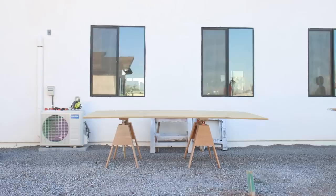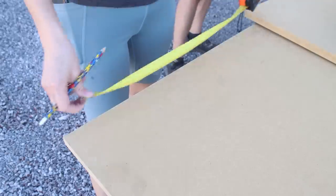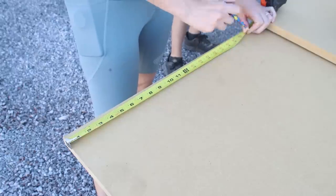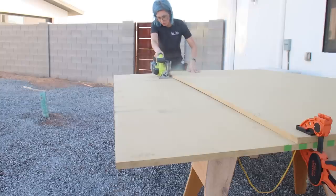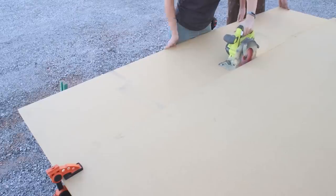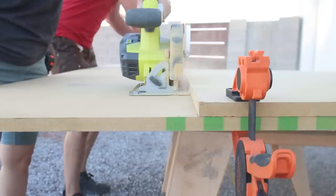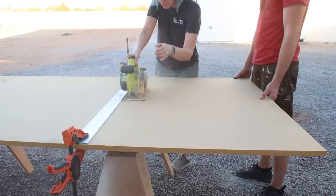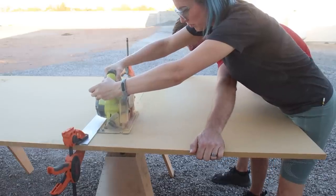With the floating shelves installed, I pulled out a piece of three-quarter-inch thick MDF to begin working on the washer and dryer surround. The existing cabinets in our laundry room are RTA — ready-to-assemble — cabinets that we installed ourselves. I wanted the surround to match the cabinets as closely as possible, which meant I got to try my hand at applying wood veneer for the first time. For wood lovers wondering why MDF instead of plywood: MDF, or medium density fiberboard, is actually what most professional cabinet makers choose for flat-front cabinet doors because it doesn't tend to warp, flex, or contract like plywood sometimes can. I used a circular saw and a straight edge to cut the two large panels that would make up the surround.